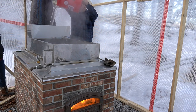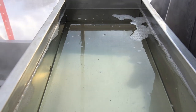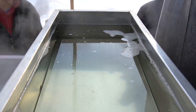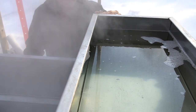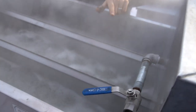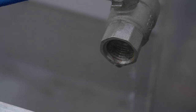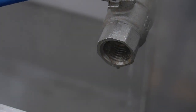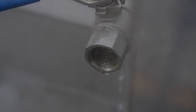The upper reservoir is a piggyback pre-warmer — just about eight gallons — and that's warming up the sap. I'll keep the sap in there and just barely trickle it into the big pan by controlling the valve, so if I keep this thing full the sap's warming up a bit before it hits the main pan.